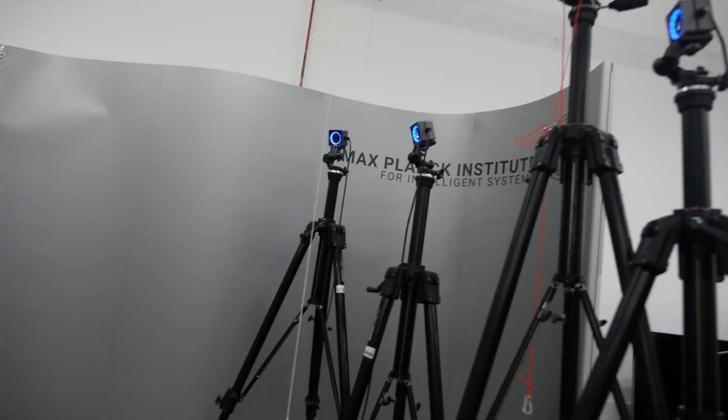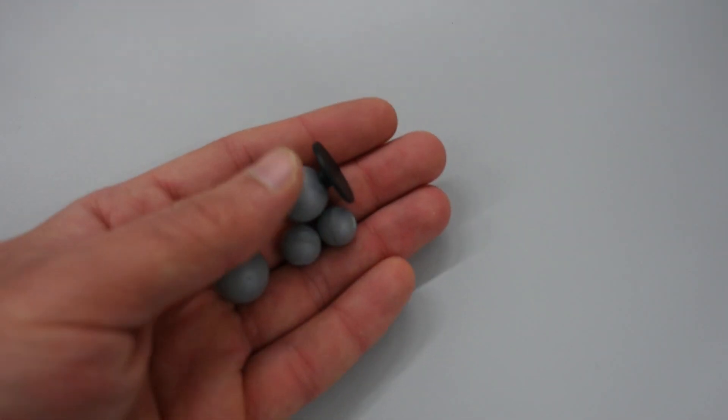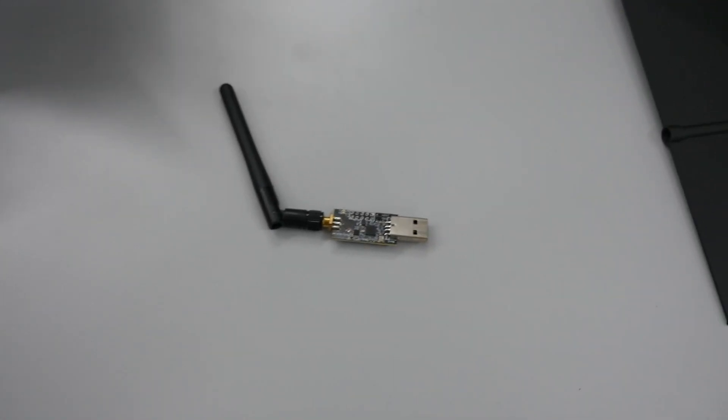To control the robot, we need to know some information about it at every moment — like its position, speed, and orientation. We can get this information using different sensors. The robot has an IMU chip, which measures its acceleration and angular rates. As for the robot's position and orientation, we can measure them using an external tracking system called OptiTrack. This system uses multiple cameras distributed around the wind tunnel. It can accurately measure the robot's position using small reflective markers attached to the robot's body. These cameras emit infrared light and detect the reflection of the markers, and the OptiTrack software processes the images from all the cameras to calculate the robot's position in real time. This data is sent to another device, which transmits it to the robot via radio.